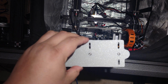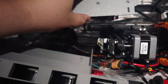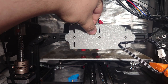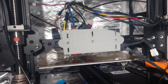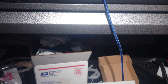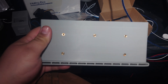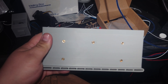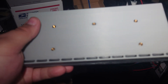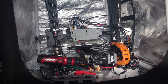Assembly starts with putting this adapter plate with the three holes up and two holes on the downside. This adapter bracket gets placed on the back of your X-axis gantry. You screw in from the opposite side that we're looking, and that goes into heat-set inserts. It comes with them, but you're going to need to set them in yourself. I just used my soldering iron to do it and it did a pretty decent job. Let's flip this machine around and screw it in.